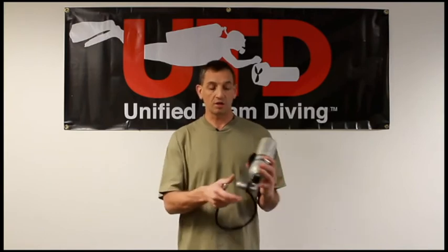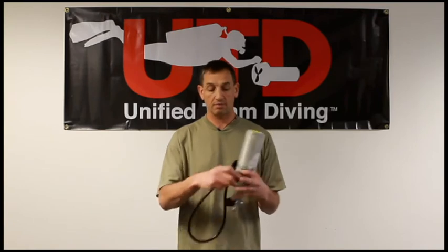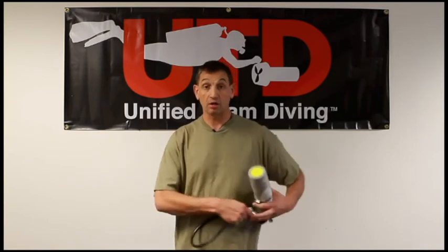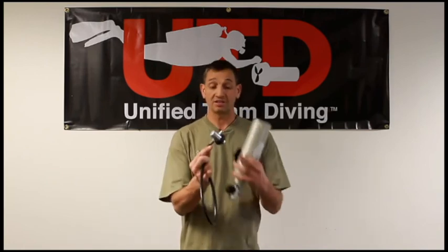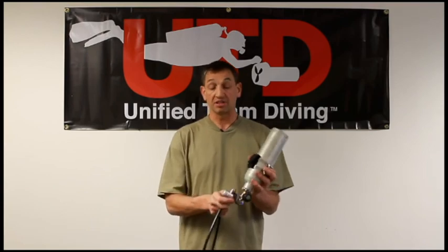So you want to make sure that your argon system first stage and hose length is the correct hose length to fit comfortably where the bottle will be, as well as has an OPV. And again, I like the DIN system that it just attaches right to the bottle.